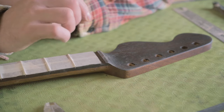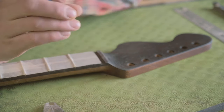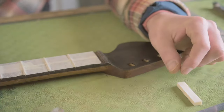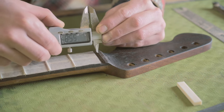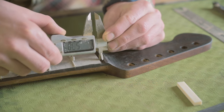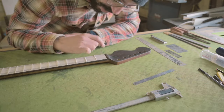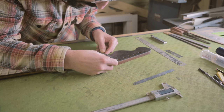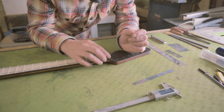The first thing I like to do is to make sure that the slot is square, so when the nut goes in it's right tight up against the sides of the slot. With calipers I'm going to measure: 5.66, 5.63, 5.63, 5.7, 5.79. We're pretty close there. I'm not going to make any changes. I think that is perfectly square enough that we're not going to have any gaps and the nut is going to slot in there with a nice tight fit.